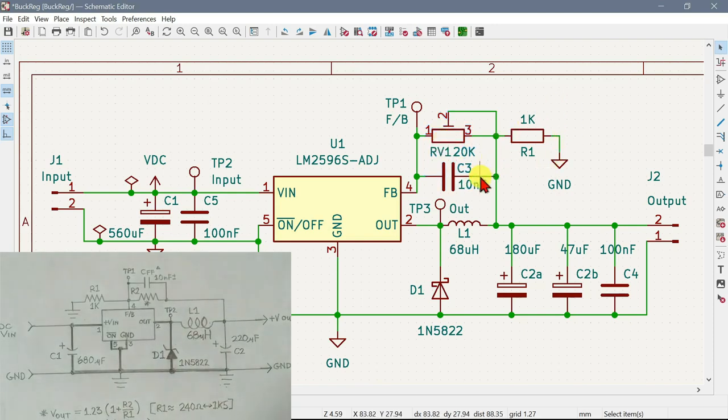Okay, so we have our capacitor, and instead of this resistor, we have our little trim pot, test point there, and we have a test point over there, which I actually haven't even got on the diagram, but I wanted to put one there on account that we want to see exactly what's happening at pin 1 on the chip, perhaps. And we don't want to measure the input at the socket, because there's a trace and everything in between and so on.